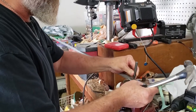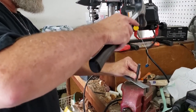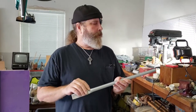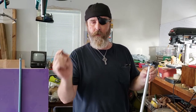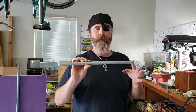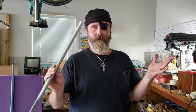Get a nice little dent in there. I've used my center punch. I've also cut this down so it's going to fit up inside the inner handle, and I also marked where the hole should be for the bolts that are already in there. Now, one thing I failed to mention — the inner handle was going to cost $90, and a new lawn mower between $200 and $300. I've just bought a five-foot length of half-inch galvanized pipe for four dollars. That's all it's going to cost us.